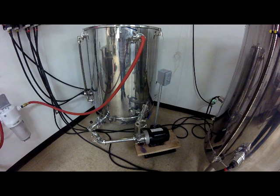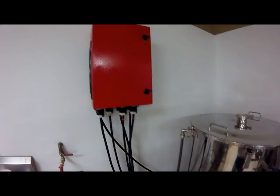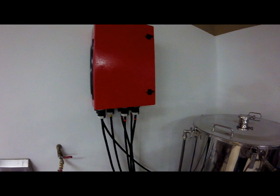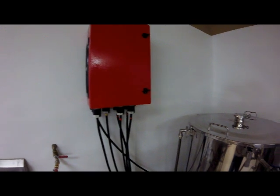It's a three-barrel, about 120-gallon HLT. Next, let's jump over to our power distribution panel. We are an all-electric brew house, so we bring a bunch of power in and heat a number of heating elements. Inside the tank — we'll show the details in a future video — but this is where the power comes in to heat sticks, similar to what you have in a hot water tank at home.